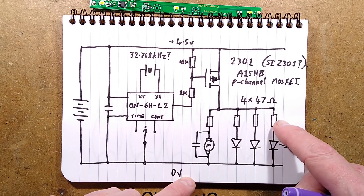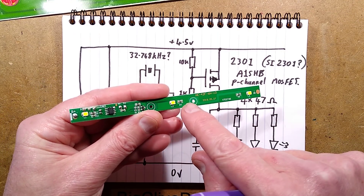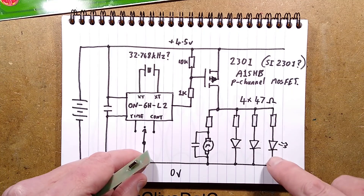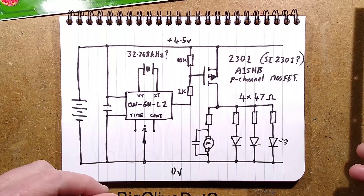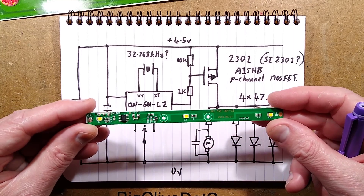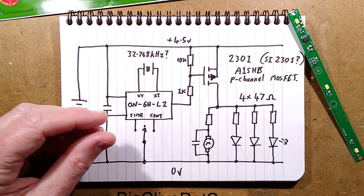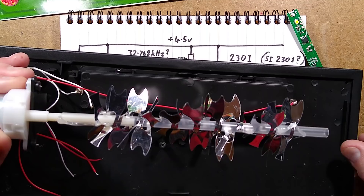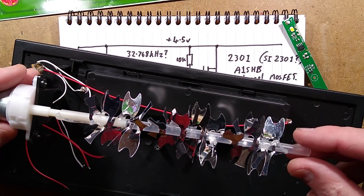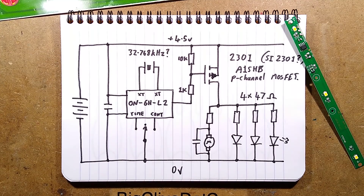Then there are three other resistors in series with three LEDs - this LED with its resistor, this LED with its resistor, and this LED with its resistor. In reality, just to shuffle the track layout on the circuit board, some of the resistors are on the other side of the LED - it doesn't really matter as long as it's in series. It's a very simple circuit. You could do away with most of the circuitry and just mount LEDs inside. It would be interesting to put high power ones in, but it's important they are a sharp point source because that creates a fairly solid reflection from the rotating mylar mirrors. Very simple, very neat - just a bit of plastic tube, hot melt glued onto the shaft, with mylar woven in and out and twisted into a spiral, rotating on the motor very slowly, just in front of three LEDs. That is it - that's what creates the effect. Very clever and quite convincing.